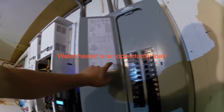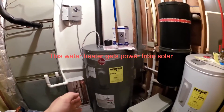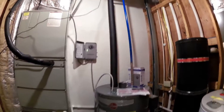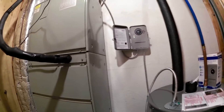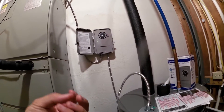What we're doing is we have an extra water heater that we've installed, and I've swapped out the elements in this water heater. They were 4,500 watt elements and I changed them out to 1,500 watt elements. I put the water heater on a timer, and we watched the system to check when it's about done with the absorbed charge — it was about 2:30 in the summertime that the system was finishing with an absorbed charge.